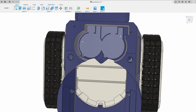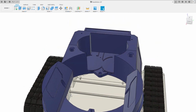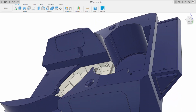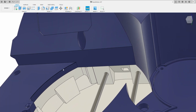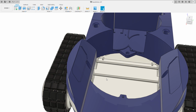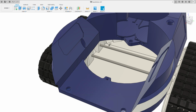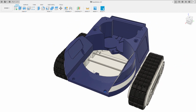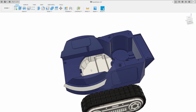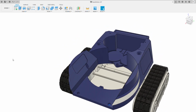The frame has these little marks on the inside here, which let the can system fit in there. You've got a couple of screws that hold the can system, and it attaches to the skirt with four screws. They're M3 self-tapping screws. This bit here is about 9 mil thick, I think, so an M3 15 or M3 20 will quite happily go into there. You've got plenty of space for those four little screws, and that holds this bit in. I have put in here three spaces for magnets, which are typically 10 millimeter diameter by 5 millimeter deep. Whether you actually need the magnets, I don't know, because when I put the base in, it doesn't need them, but hey ho.